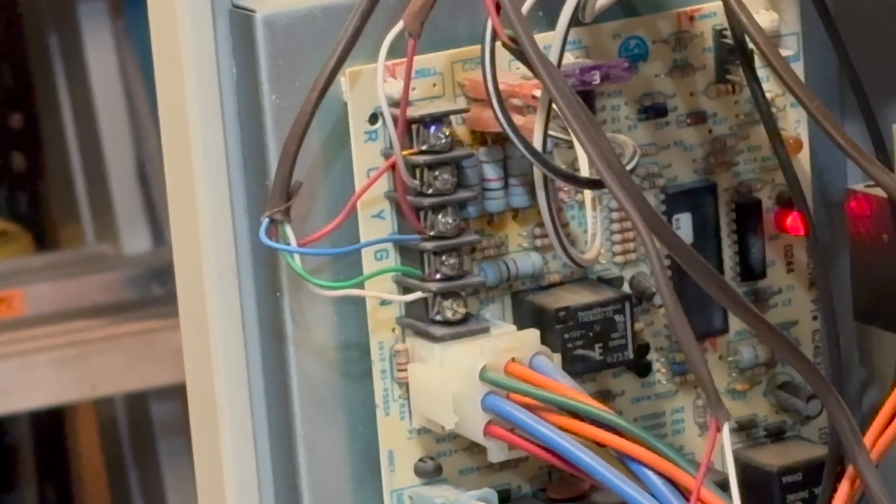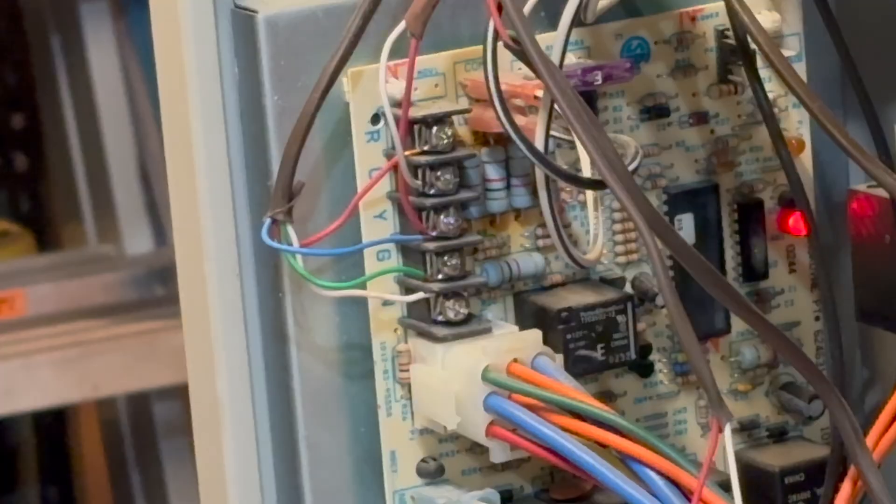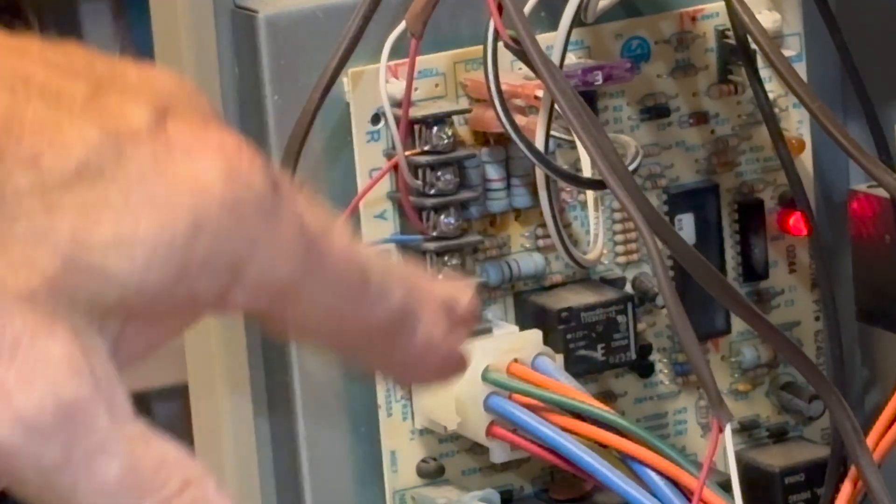So if you're going to run your own thermostat wire — a two-wire — you just hook to the R and G and run it up there. I used the jumper wire because I have a log house and didn't want to mess with running wire through it. That's how I did it, and that's how we did most of them when we were doing the outdoor wood stove installs.